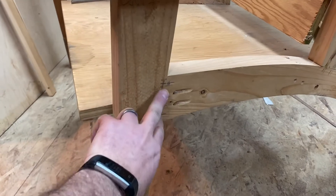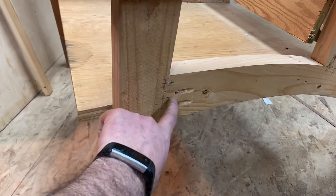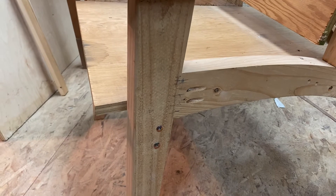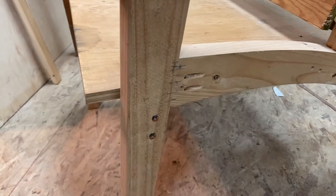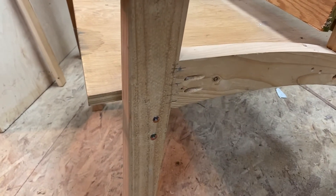What you can't see in here is that I do have dowels going through here — at least one dowel. The dowel is going to be the lion's share of what's supporting the weight. If it were just a dowel, eventually this thing would start to wiggle loose and then the front leg would become separated from the back leg, and then calamity starts.